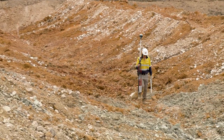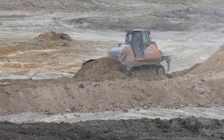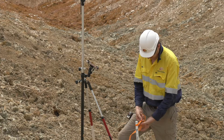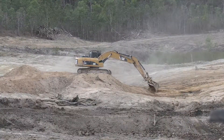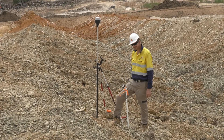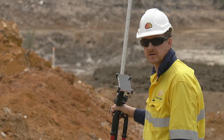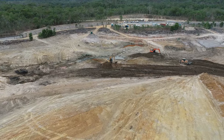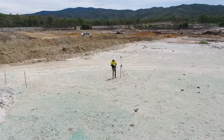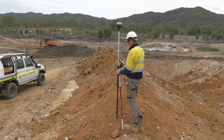Today we're marking out the alignment of a drain. As you can see, there are cut values written on the peg, meaning that the earthmoving equipment is going to be reducing the ground level in this area and making the drain wider. The earthmovers will take a reference from the base of the peg to understand how far down they have to take the ground around them. You've seen how we can use ReachView 3 to bring points from an external data set into your controller, go out in the field, identify the location of those points, and identify the relative elevation of the design surface. It's a very powerful feature that comes with the ReachView 3 application, which is free with your Emlid hardware. Thanks very much and be sure to check out our other videos.